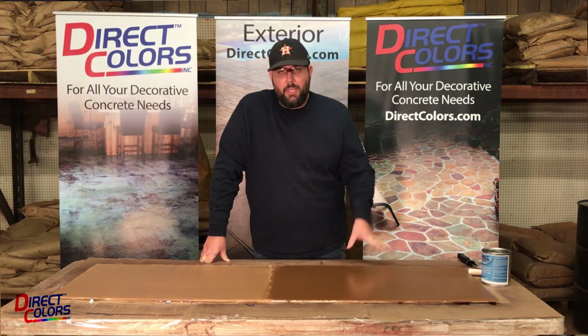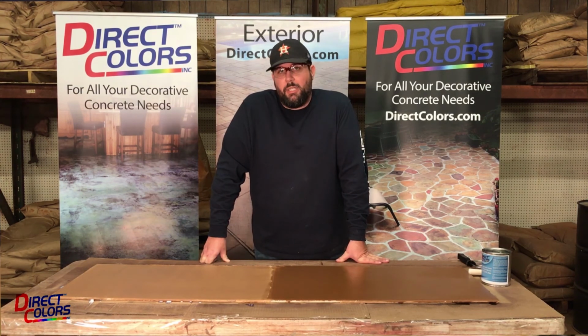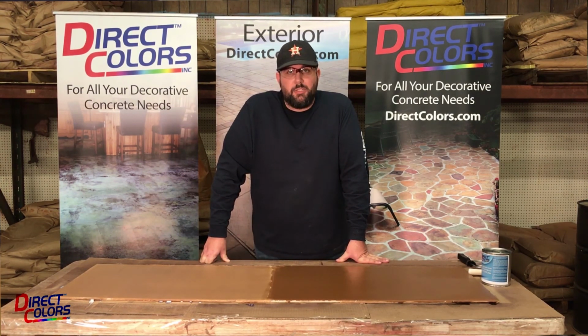For interior, your next step after your second coat has cured for about 12 to 24 hours, you're going to need to come back and put a floor wax and polish on it. The floor wax and polish is an important step because that is your maintenance coat.